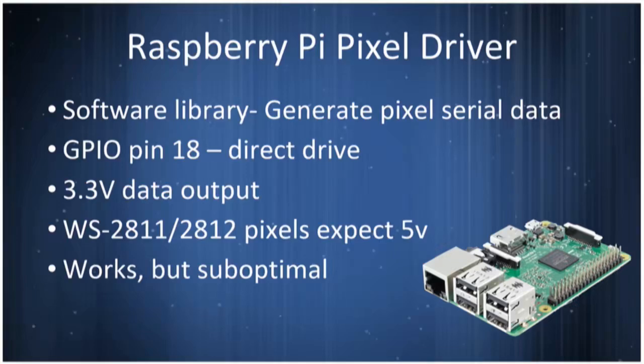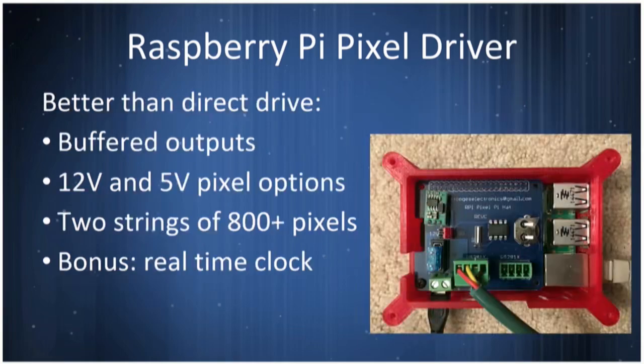So the other thing you can use besides the big controllers I talked about are Raspberry Pis. The GPIO pins on the Raspberry Pis can drive these lights directly and independently themselves. You can't get the same quantities that you do with the large controllers, but they're a cheap way to get started. You can make small elements for your house, and as you're building something new up, you can add them, prototype them, and then put them in the larger display later.